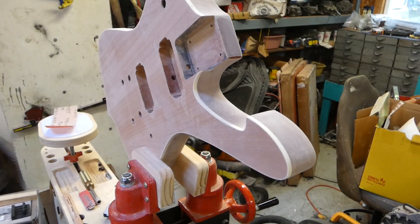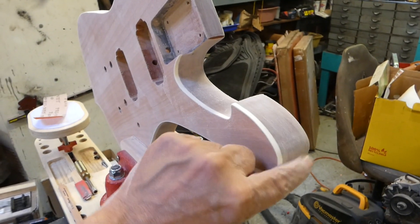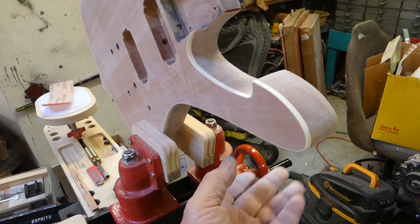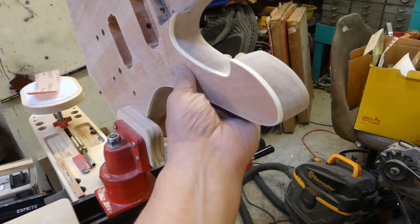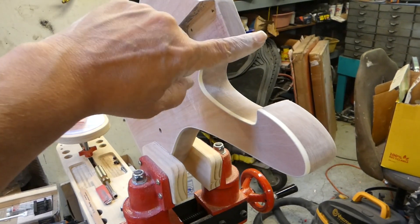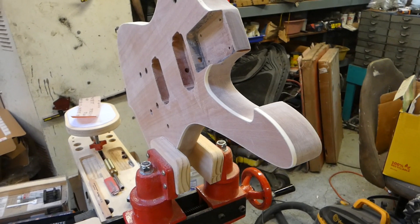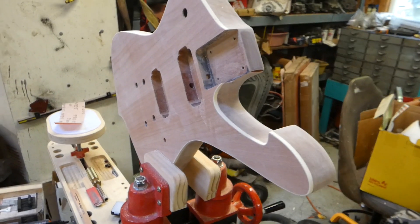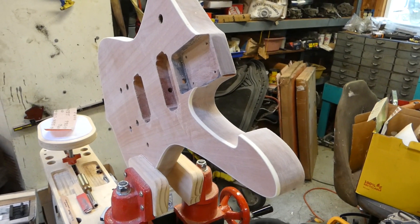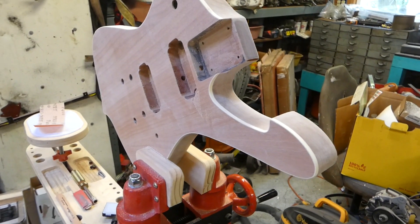Here's an interesting fact — maybe it's not interesting. Out of this whole entire shape, I can use a sanding block or a flexible sanding block on every one of these little curves here. Of course the front and the back I use a nice flat sanding block. The only place that I have to do by hand is from right here to here. Everything else is done by block, if that makes any sense. So I'm going to go back to finishing this up — I just finished the 240, so it'll be 320 next. I'm just waiting for the heat gun to show up, so I'll be back.